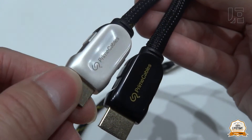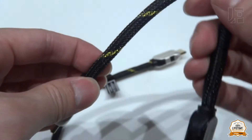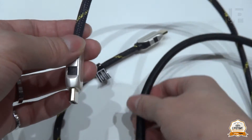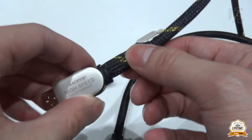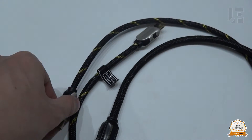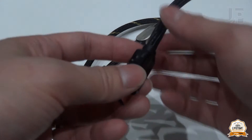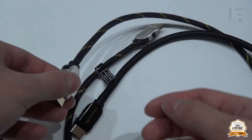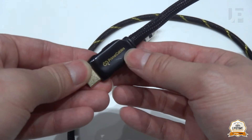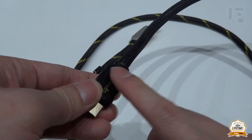With regard to HDMI 1.4 vs 2.0 cables, while it's true that as an interconnect cable carrying a digital signal, either it works or it doesn't. Many times you'll be able to get away with using a high quality HDMI 1.4 cable between 2.0 sources, but some devices like Blu-ray players or receivers are very sensitive and they won't complete the HDMI handshake. Fortunately, the price difference between 1.4 and 2.0 cables is now very minimal, and you should only be investing in 2.0 cables as they're also backwards compatible.